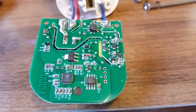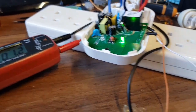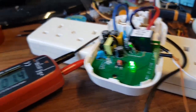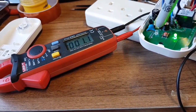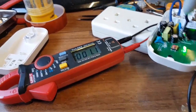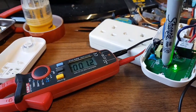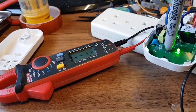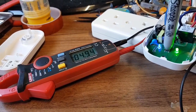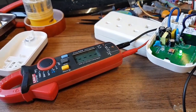Straight from there — make this safe. Shall we fit some wire links? It's now powered up and killable, so it can kill you. Got wire links hooked up to the input of the relay, across the coil. There's my voltmeter measuring nothing. I've got a green light saying it's powered and can see the internet, and the blue light is relay on. Push the button with a pen so I don't let it kill myself. There you go — volts across the relay. So nothing across the relay. Is it now working? Because I can hear it ticking.